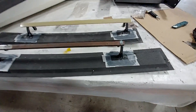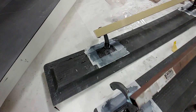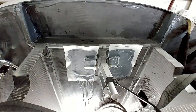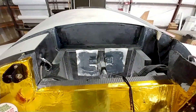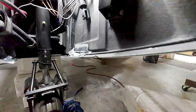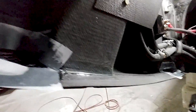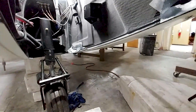I've put the resin-flox mix in all of them and I'm doing two layers of medium-weight carbon fiber over them to set them up nicely and get them bonded in. This is how it looks on the doors themselves — I still have the supporting rods on, I'll be breaking those off next week. I've got everything bedded in with the layup done. Likewise Jeff and Devin got the layup done on those brackets — they're in there now and just need the longer actuator arriving next week. By end of day I had these ones done as well, with peel ply around the edges to minimize cleanup of any sharp bits.